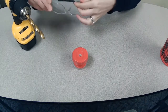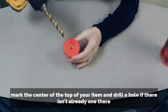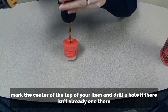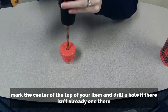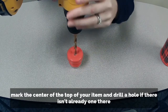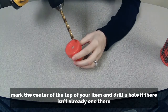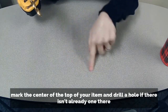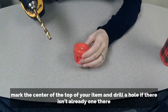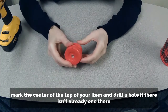I'm going to put on my safety glasses and demonstrate how you would drill this. Anytime you're drilling, make sure the drill is straight — both up-and-down and side-to-side — then gently press through. If you were actually drilling, make sure there's something below the object to protect your surface, and mark the center of your item ahead of time.